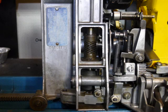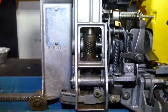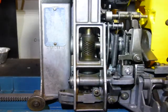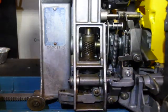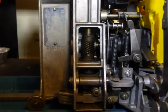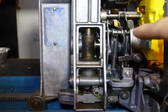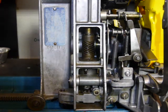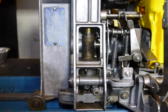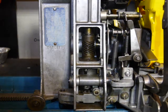Clutch three is done with the mechanism in the play position. You reach forward, activate the shifting lever, and bring the mechanism into the play position. Moving the turntable, you can see the play notch coming up. You go until the shifting lever and roller drops into the notch fully, and now you are in the play position. The manual describes that in both of these positions, you must make sure that the cam is fully engaged up or down. At this point you've adjusted clutch two and you're moving on to clutch three.